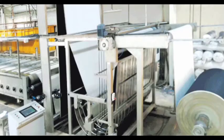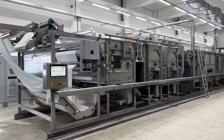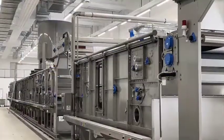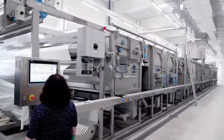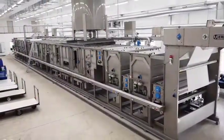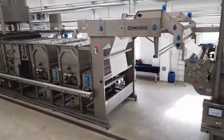Working procedure of the CBR machine. Step 1: The cloth is taken from the batch through the guiders and guide rollers into the J-scray, using a beater roller to remove any creases in the fabric. From there, it is taken into the padding unit with the help of bow rollers to prevent the formation of creases in the fabric.